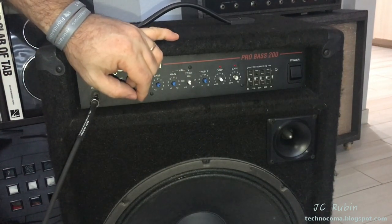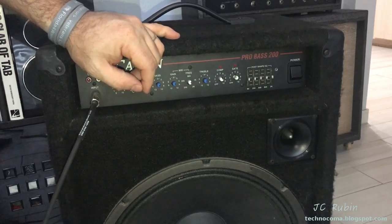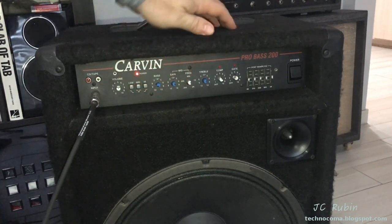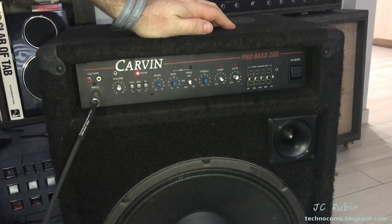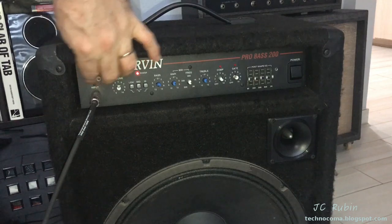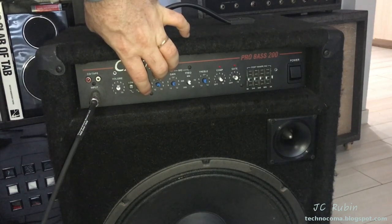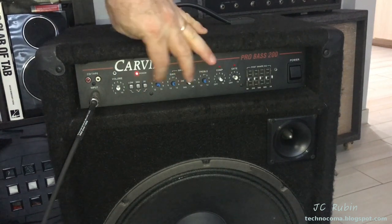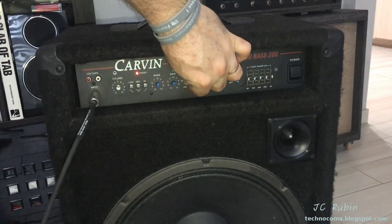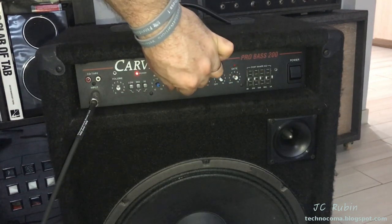The issue with the speaker is gone, as I suspected. All of the crap on the bottom of the speaker was causing it to vibrate. This is the lowest note I got — kick up the bass. Not distorting, very happy. These buttons have an effect, but only on the instrument input jack, not on the RCA input. So those buttons work, the volume works, the bass works, the gain works with the frequency adjustment.